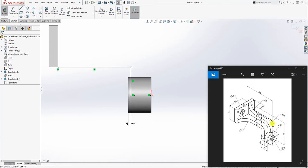So since this radius up here is 25, the radius down here wouldn't be 25. How you get this radius is, the distance from that top face to the next level is 10. So you subtract 10 from the 25. That means the radius at this point is going to be 15. And the next level is 10, so you subtract 10 from that 15, which means the radius at this lower bottom is going to be 5. And everything is going to make sense once we're done.